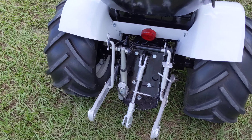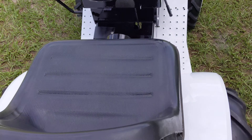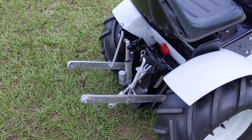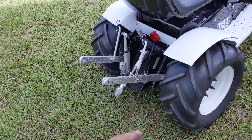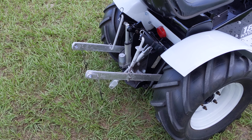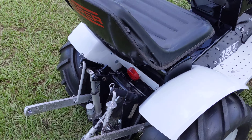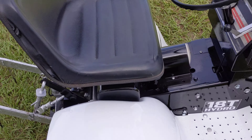The electric three-point hitch works. This actuator is a little bit smaller than I wanted, but it works. You have to have the engine running to power it, because I hooked it up directly to the charging system on the engine. There's two wires — one wire that would go to the lights, and one wire that goes to the battery to charge it. I hooked this to the wire that would go to the lights, so that way it doesn't run the battery dead. This thing doesn't use a whole lot of power anyway.